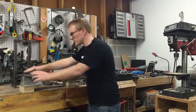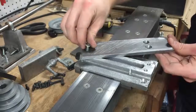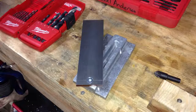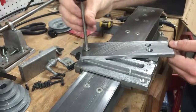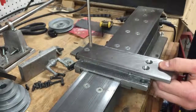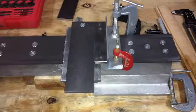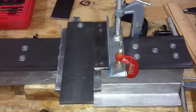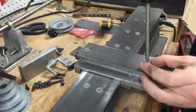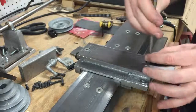Once you've got it all scraped, you should be able to slide along the entire length without any binding. Then you need to mount the cross slide ways to the carriage base. You do that by first drilling and tapping a fastener on the far side of the carriage base, and that allows you to rotate the cross slide ways until they're perpendicular to the bedways. I used a piece of angle aluminum, clamped it to the bedways at perpendicular, shimmed off of that to get my clamps in place, then C-clamped it and took it to the drill press to match drill the mounting holes.